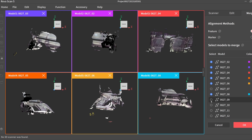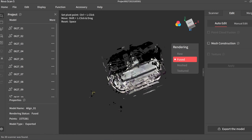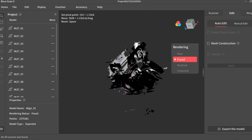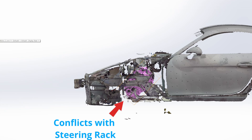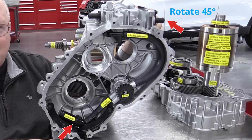Here are the scans. I realize for those who are not 3D inclined this one might be a little challenging to see, but these are the surfaces of the inside — I'll call it the front engine bay. We're going to see where this motor can live. The motor position as Tesla has it isn't going to work super well for the space that exists right now — I'll either need to cut some of the panels to allow access. I think if I tilt it about 45 degrees, the gear oil and transmission fluid pickup is still in an okay spot. If you guys know better, please leave your comments below.